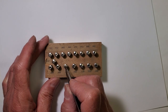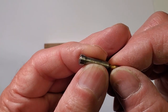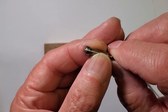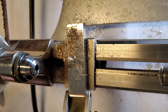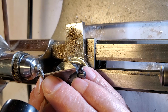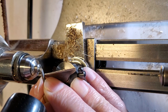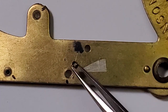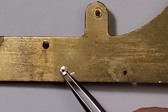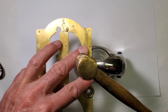It fits this chuck just fine. Turning this brass adjusting screw, the bushing can be adjusted out slowly. I'll adjust the bushing out to expose only the excess material that needs to be removed — just a small amount. The bushing is ready to be installed. I always press them in from the back side. Just a couple taps and it fits like a glove.